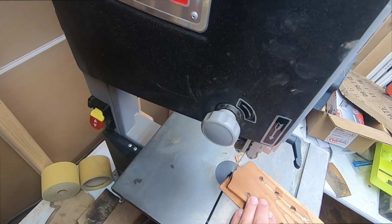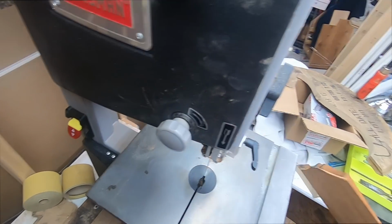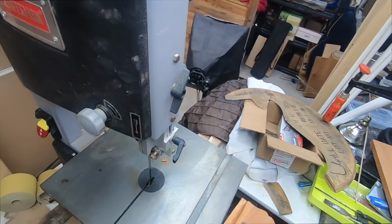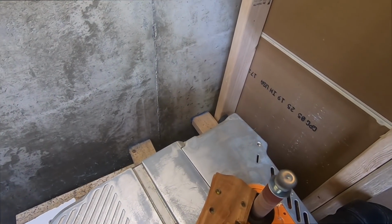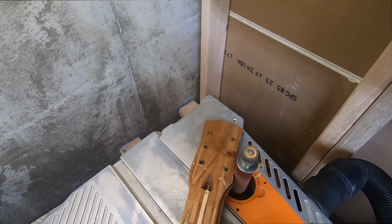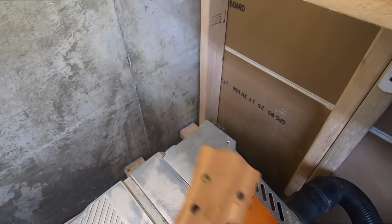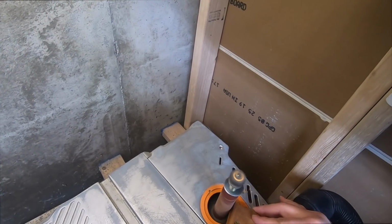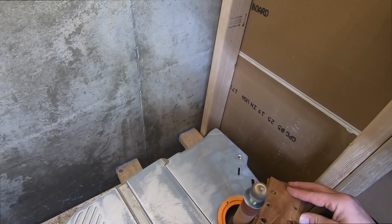And filming with GoPro is a little hard sometimes because on this saw I can't get the cut. So after we trimmed it, we went right to sanding it. So I sanded it so that it was just flush. You just want to take off a little bit of the edge just till you get up to it. You don't want to sand too much. So we'll do this on the sides and the top of the headstock.